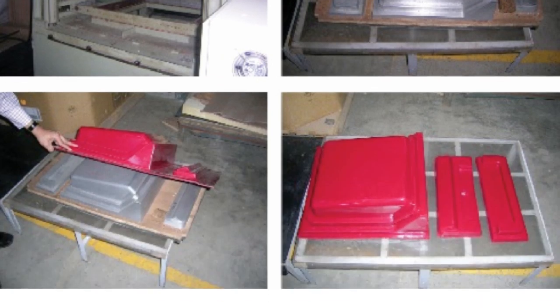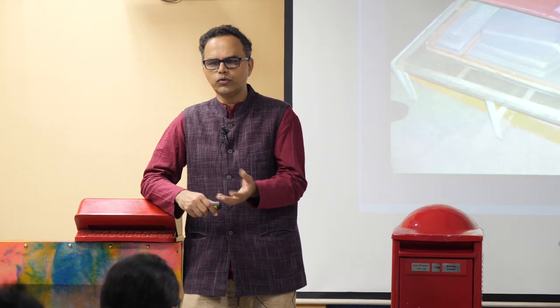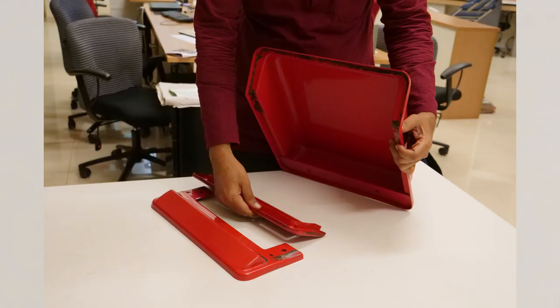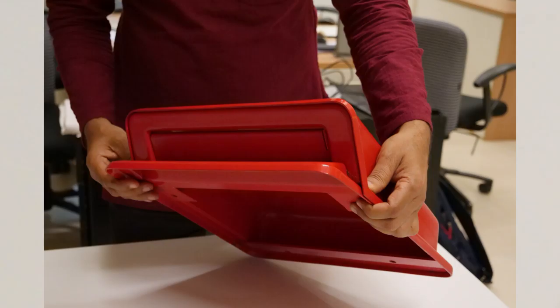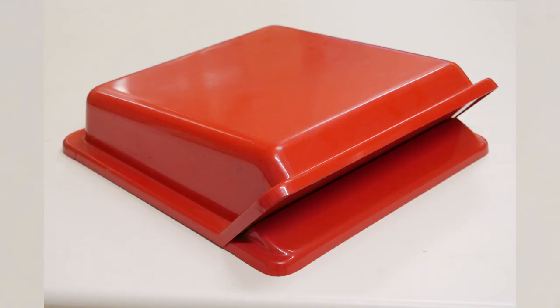Finally, you cut all the parts together and we joined them using the best adhesives from Huntsman, a manufacturer of adhesives who makes them stronger than the virgin material. Today adhesives are very high tech — you have very good adhesives in the market which are as good as the original material. And then we now have the composite thermoforming top — lightweight, formed out of three parts: one part, a front part, and a flap which goes in. This was very mass manufacturable to a level of 200 numbers. The whole business when you come to large volumes like 200 numbers is cost.